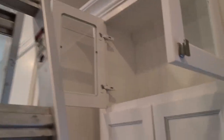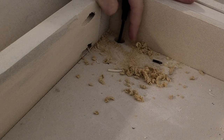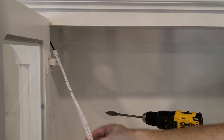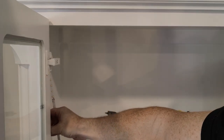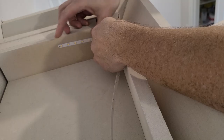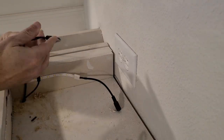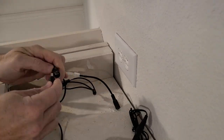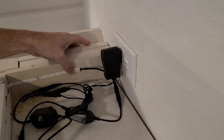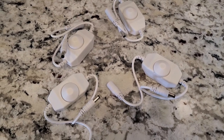This is the cabinet to the right of the hood, and the process is just the same. I drill a 3/8-inch hole on the side closest to the outlet, feed up the two cords that are going to light the inside of the cabinet, peel and stick those, and peel and stick the one that's going to light the top of the cabinet. Again, I wire the inside ones to their dimmer, the top one to its dimmer, and wire both of those to the same power supply. At this point I ran out of dimmers, so I had to buy four more — I'll put a complete parts list in the description.